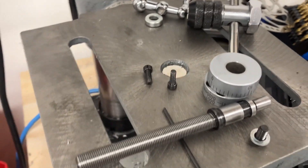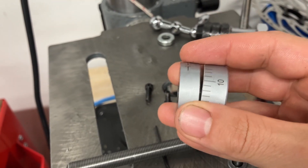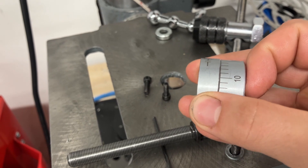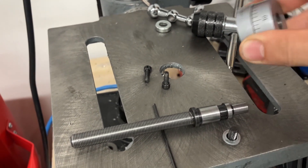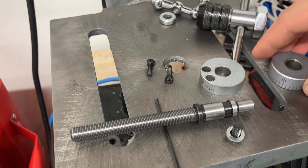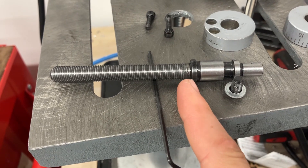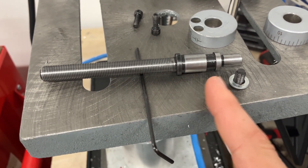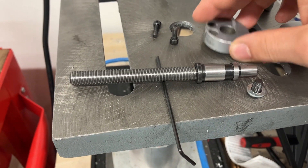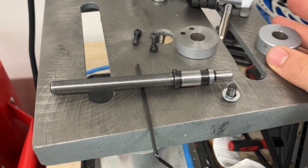So I just want to go over what I'm doing to fix that. Where these two rub together, I'm going to put a needle bearing — or a thrust bearing, I guess — between the two. One of the restraining things is when these are assembled, it must fit between these two, which I think is 24 millimeters. I was able to find a thrust washer — a thrust bearing, I should say — that's two millimeters thick.